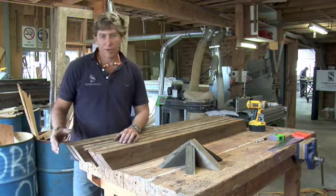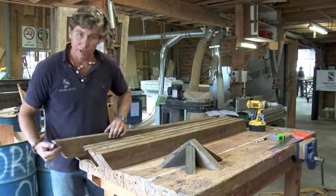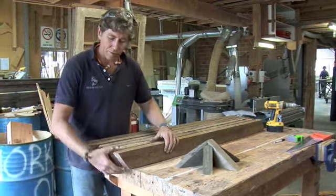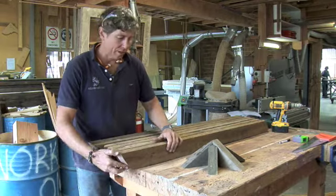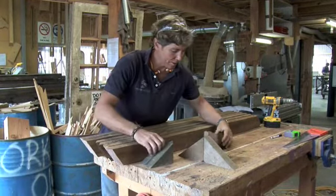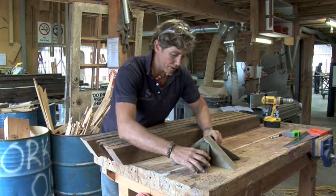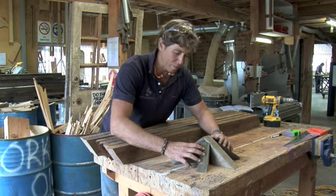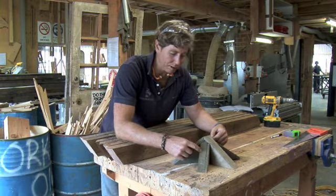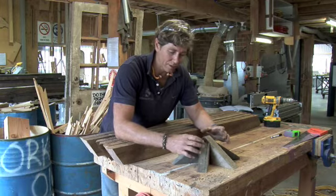When it comes to making the rafters, each different type of rafter has a different end on it. The primary rafters have a 35 degree plumb cut and then they're cut square; the secondary rafters are cut with a compound cut; and the tertiary rafters are cut with two compound cuts. This is because when they meet in the middle, the primary rafters go together, the secondary rafters come together, and then the tertiary rafters go in there to finish that apex. If you're building an octagonal veggie patch rather than the hexagonal one, there are four secondary rafters with different angles — but it's still the same principle, they still meet together in the centre at that crown junction.